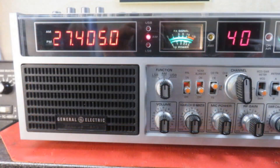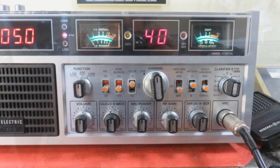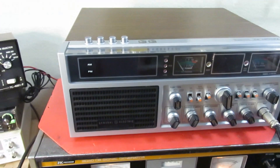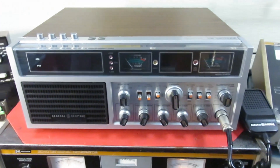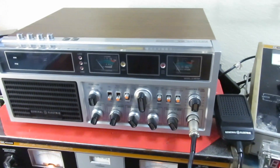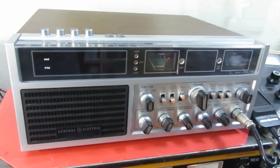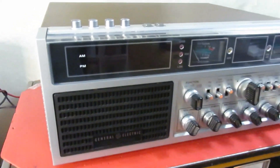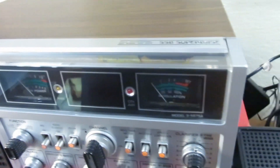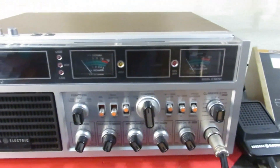I took the knobs off those so you didn't continue to monkey with it anymore. Hey, this is Bruce over at Be Cool Radios. We just finished up this GE Super Bass. I've gone through it — I removed the face plate, replaced the capacitors in the audio circuit, cleaned all the dust and polished this lens. Yeah, it's really turned out great. What do you think?